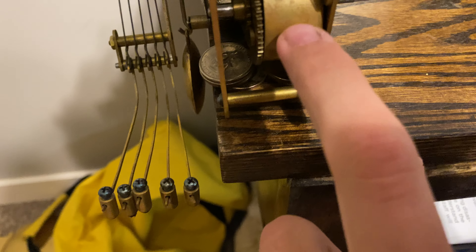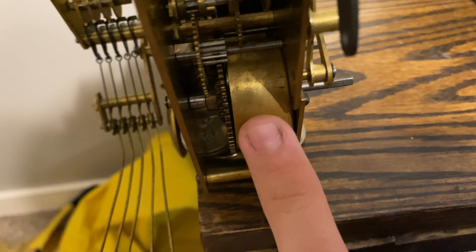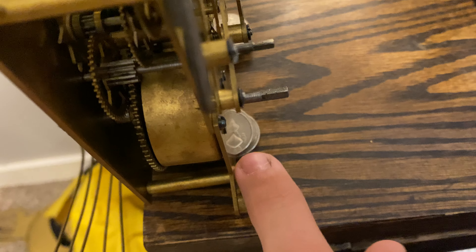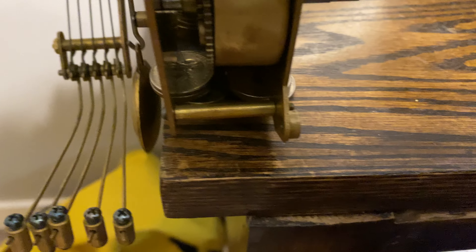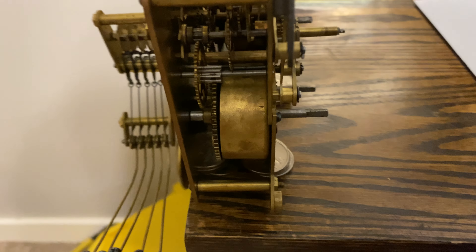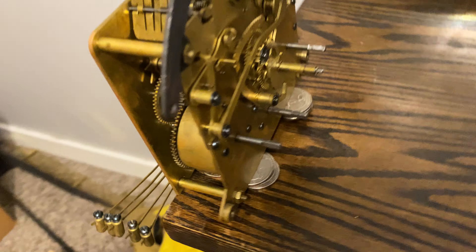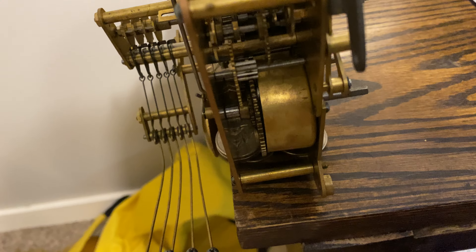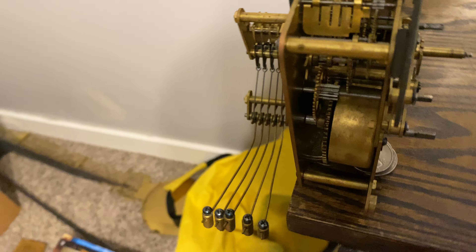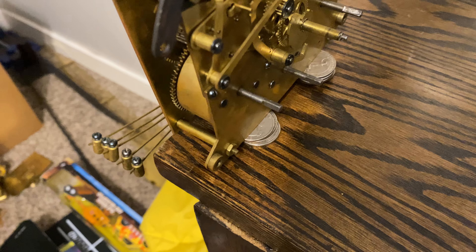This barrel here is not even connected to this gear right here. This is actually just a can that is attached to this front plate that's separate from the main plate, and that can is what the mainspring sits in. So the only way to get the mainsprings out is to make an arbor of your own that'll work in the mainspring winder, or you can just pull them out and wind them back in by hand, but that is dangerous and there's controversy about that, which is that it can distort the spring depending how you bend it.